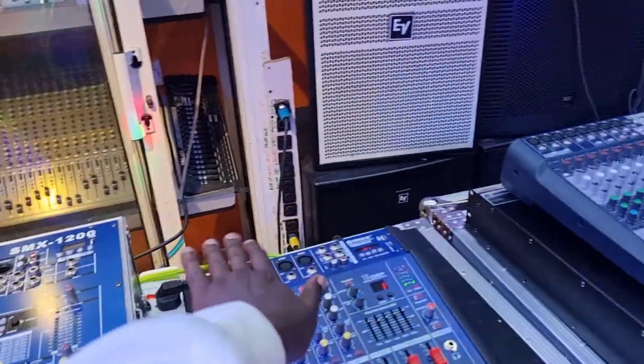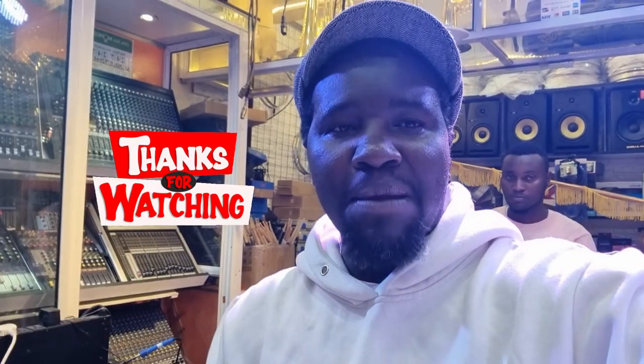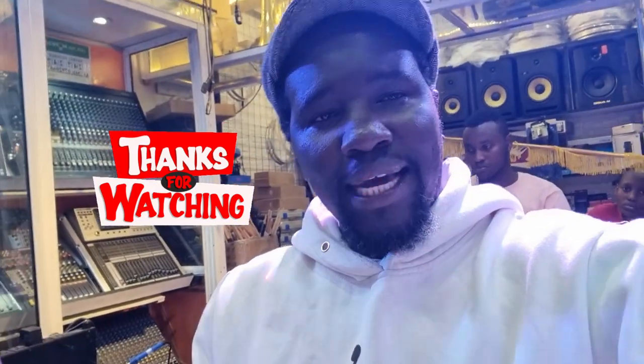Out, in. You feed all your inputs from this one, you put them into the main mixer. As simple as that. Where does it apply? Let's say perhaps you have drum set microphones and you have a small mixing console, and probably you have another small one, so you want to combine them and make them work as one unit. You take the small mixing console, feed all your drum set microphones, then you only use two signals to bring the signals out from the small one to feed your main mixing console. So you will have saved on space using your two mixers.